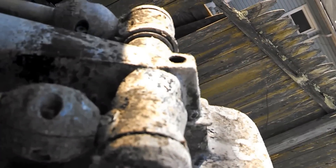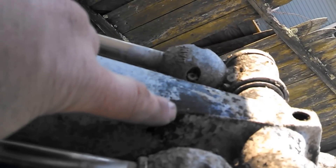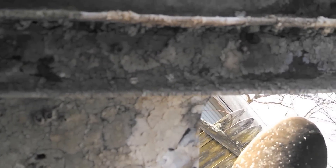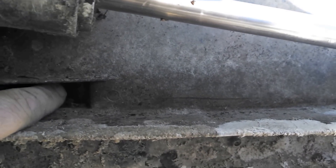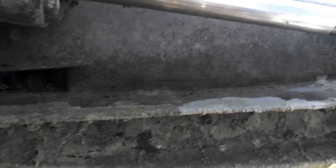And then the other feature: where the trim cylinder mounts, it mounts to the very end of the drive. It does not mount back here like it does on the Gen 2. Also, how the upper and lower cases bolt up — you don't have those exposed bolts showing in this area over here. The mounting bolts are here and they're underneath, and that's what holds the two halves of the case together, the upper and lower, with no bolts over here.